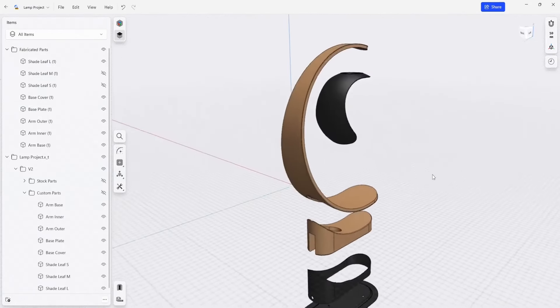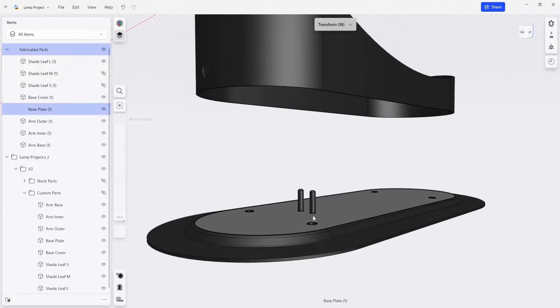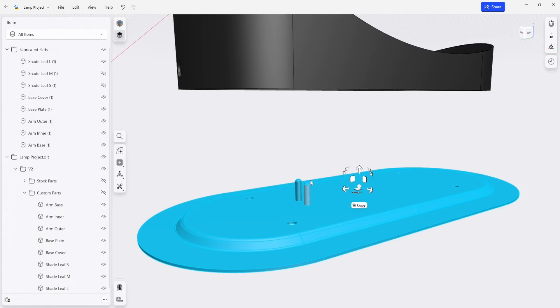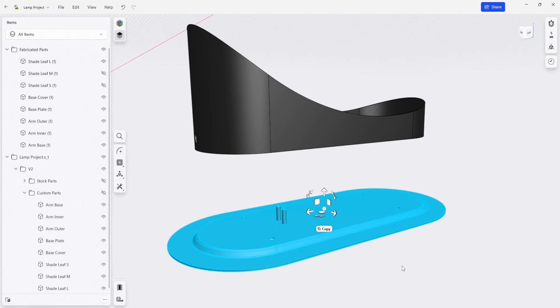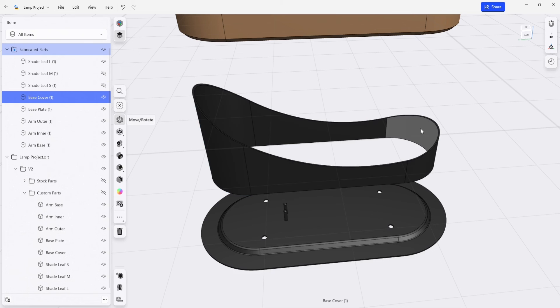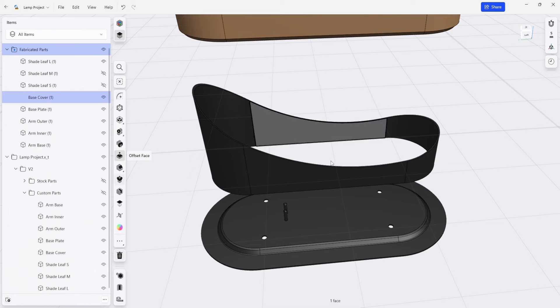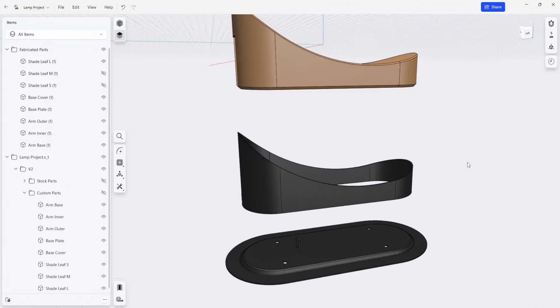This bottom plate has two posts that appear to be pressed in place to hold the terminal block inside the lamp. We're going to ignore these for now while we're generating our die for the form. While fabricating this bottom base cover, we're going to assume it's composed of four pieces welded together — two half pipes on either side and a flat face on either side — cut from stock material and welded along the seams. We'll make a fixture to hold those pieces for welding and shaping.